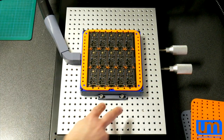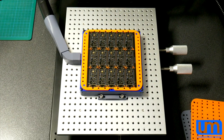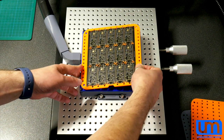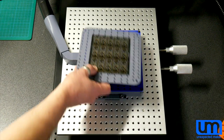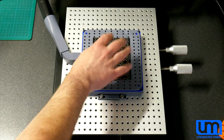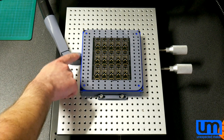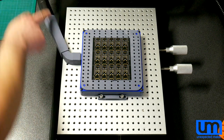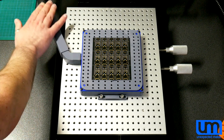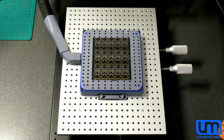So this is my final setup. As you can see I've got little clamps that hold down the tabs. My actual base could have been a little bigger, but I have some issues printing right to the edges of my 3D printer. I've got a Feather S2 panel in here right now on this particular adapter, and you can see the adapter just comes out — I can take a different one and just put it on and down it goes. I don't really care too much about the exact tolerance of my PCB because once the stencil is down I can adjust from the sides and the front to get all the alignment right. You can see that my vacuum tube is going off the side — I've only got a certain amount of clearance once the stencil is in place, and I've just barely got enough. It's almost touching at this point, so I've got a square exit that goes through into here.